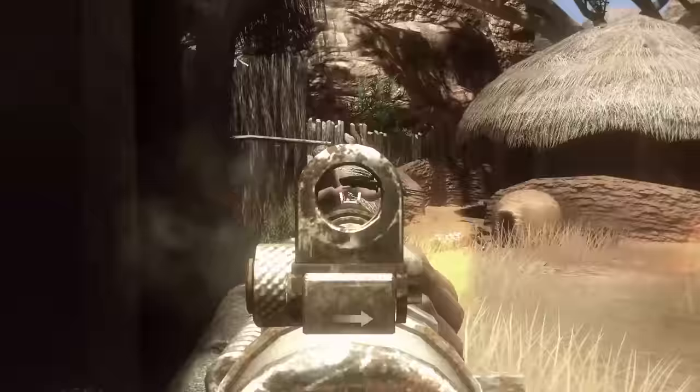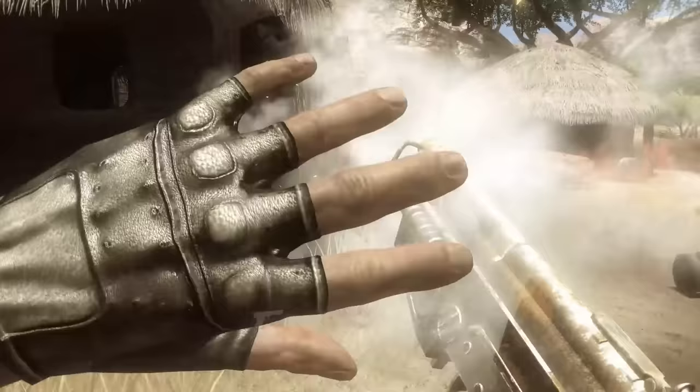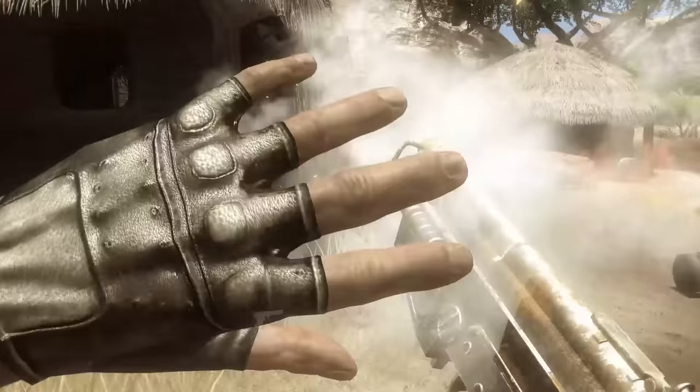In this detonation animation, the entire front end of the gun has blown off, which I don't think is likely. Barrels are either threaded in and torqued to a certain spec or pressed in — an extremely tight fit — meaning the back end of the gun, the receiver in sheet metal or thin machined metal, is more likely to give way than the relationship between the barrel and its barrel extension or trunnion. So it's not a hugely probable way for a gun to explode.